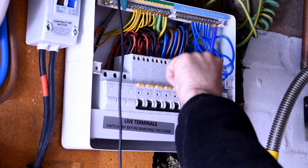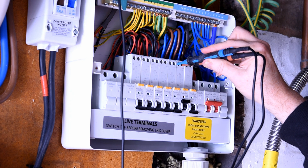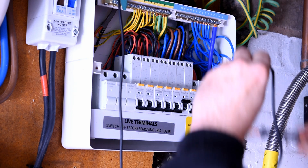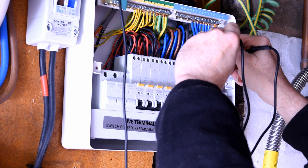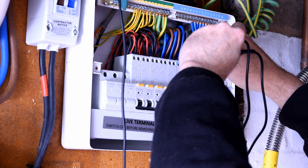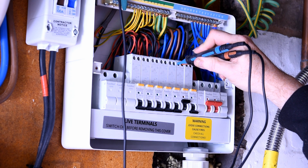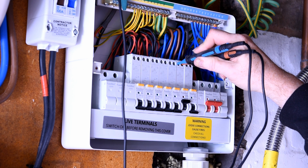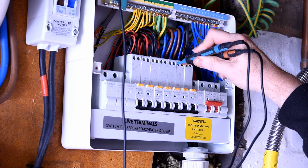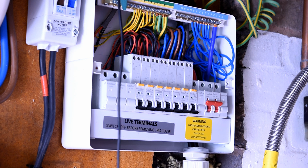Right, we'll change it to type A now. Don't forget to turn it on. Type A this time - greater than 2000. It's not easy doing this and keeping the probes actually connected. So we'll do it two-handed this time. 33.6 for the first times one. 23.6 for the second times one. 13.6 for the first five times. 6 for the second five times. Take those probes off. Right, so that's the hob done. Now we move on to the cooker circuit.